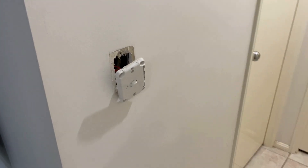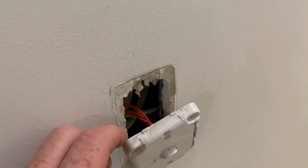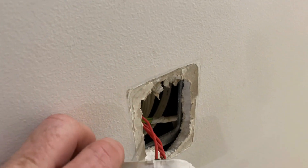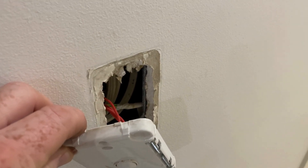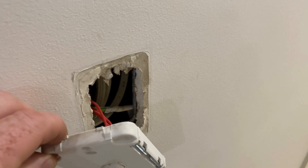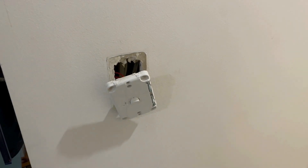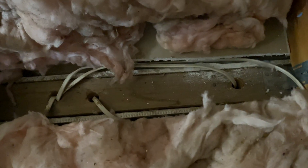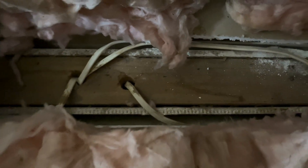This is going to be the location for the indicator panel, next to the light switch in the hallway. I've removed that light switch from the wall. I'll drill a hole through the top plate and drop my drop chain down the wall - that's going to be connected to the cables - then I can pull that down and start terminating. I'll draw another hole next to that cable there so it's got its own entry and start feeding them down.